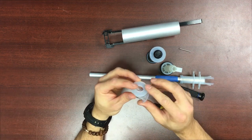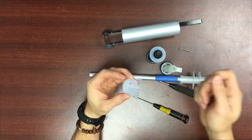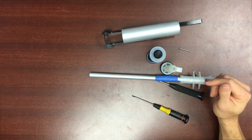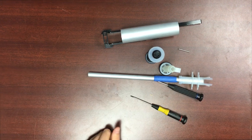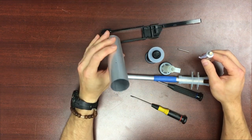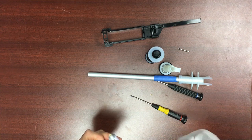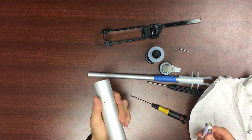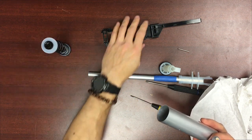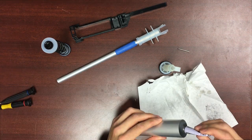Next step, we will be greasing this heavily — this is totally dry on the inside. They are cleaned as they come from the manufacturer; there is no oil. With aluminum you sometimes get a thin coat of oil with steel components, but you don't need to clean these parts — you will need to add a lot of grease.